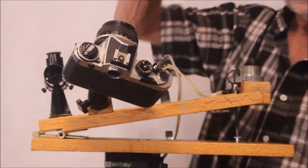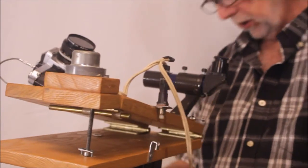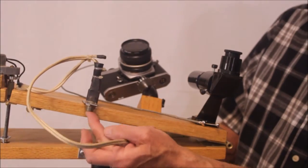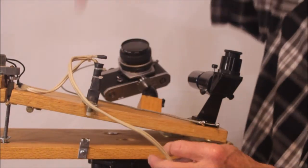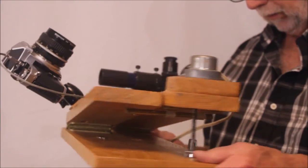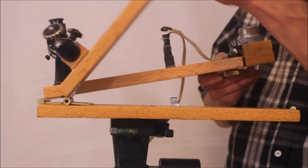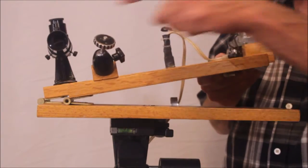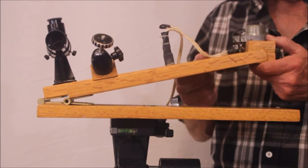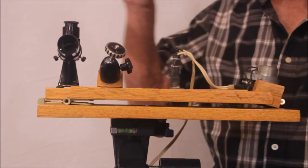Here's my camera — this is what's called a cable release, old-time stuff. I'm not going to show you how you load film; read the history books for that one. This thing here is just a momentary off switch so that when this thing drops down, instead of getting jammed, it will just turn off the motor when it gets close enough — basically a cutoff switch. Now you're looking down the polar axis. This is just a floating board where the camera is sitting. This is the driven board. As this moves it tracks, and the other board does something just slightly different — just different enough to compensate for the tangent error.